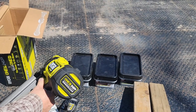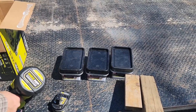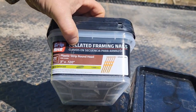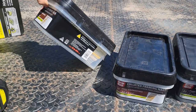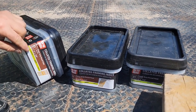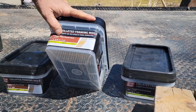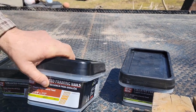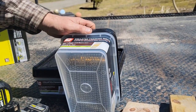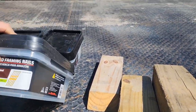I'm going to have to put nails in it. What we got here is I bought three-inch ring shank, plastic collated. There's a thousand in a box at Home Depot — Grip Right, they're good nails and they're exterior so they're galvanized. I also got two and three-eighths, good for one-inch sheathing, and then two-inch which is basically for plywood. If we're gonna put two together I'll put the threes in.